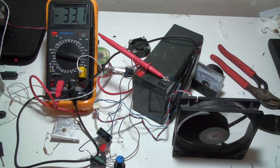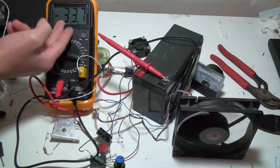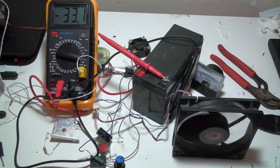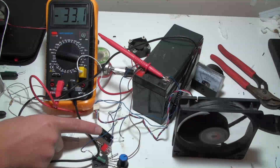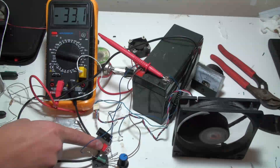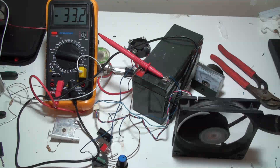Here is the basic prototype that I have here. I've got a 120mm fan and an ammeter measuring in milliamps. Here is the basic circuitry — the MOSFET is right here, that's the capacitor I was talking about, there's a toggle switch for that, and there's also a 10k potentiometer here to change the speed of the fan.